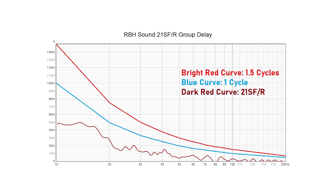It should be an overall improvement in your room specifically. In a larger environment, you might want to keep some vented subs for output purposes, because you can get a six to ten dB advantage in output capability with a vented sub in a large box with a good size port. Even with the vented subs, we keep the equivalent system Q very low — it's ported really low so that the overall Q of the system stays relatively low for a vented system, and it keeps the group delay low as well.